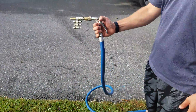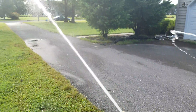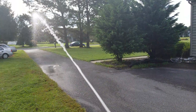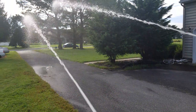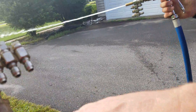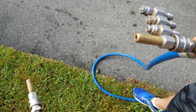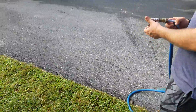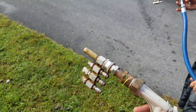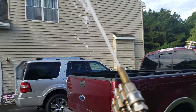Kyle came down to try both out — booster versus air. This is a three-quarter booster, five horse — we're getting good distance. Shooting the air, that's a half-inch Yamada. We're both using five-and-a-half or five-gallon-a-minute innovative shooter tips, which is probably the most consistent tip we're going to get out of this. Let's see — spray the house — we're just using literally just water.